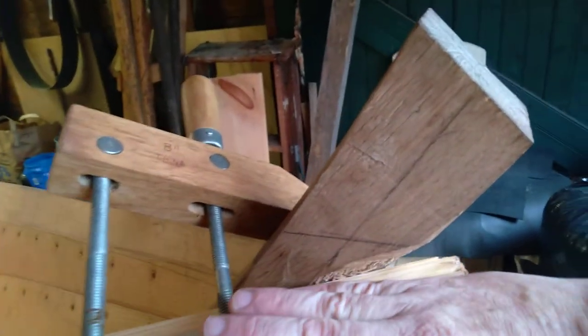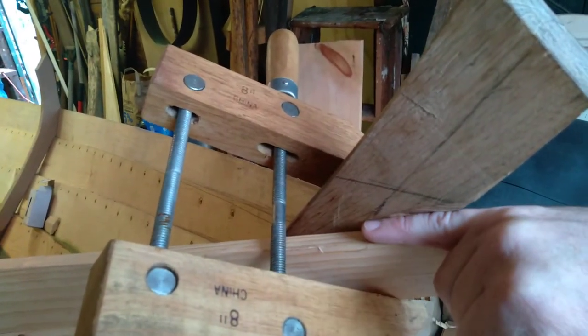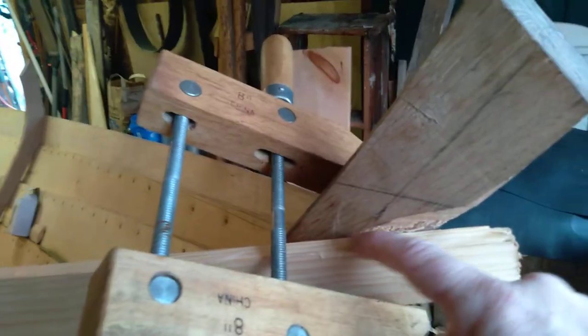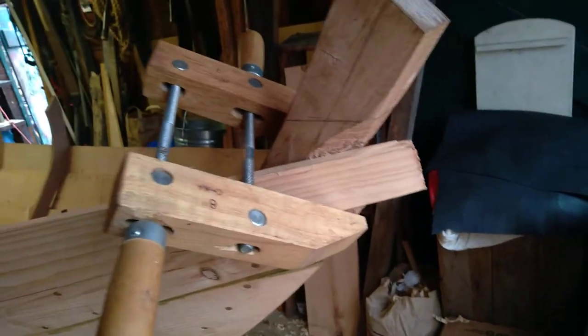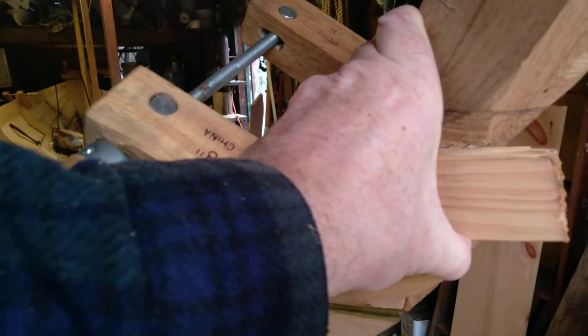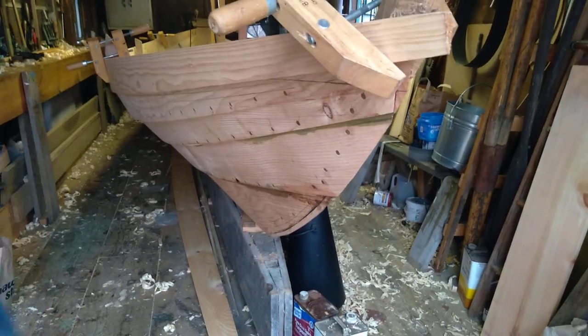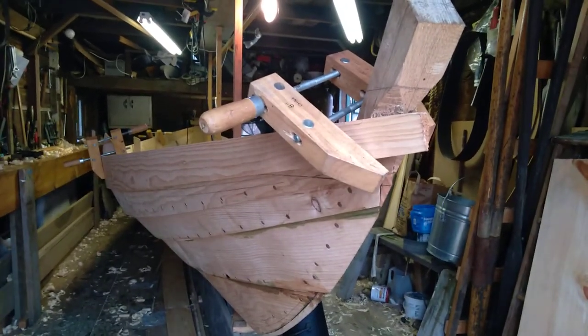Because then what I could do is put a saw on the top edge of this plank and saw in to the bevel and then cut that bevel to the height that this plank is going to be. Now, it's kind of neither here nor there, but I missed that a bit. But we are still going to have to cut it back, and this plank is coming up a little ways, so there will be a bit of a cut to make there. We'll see how deep it is, but yeah, let's mark that and cut it.